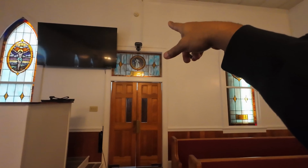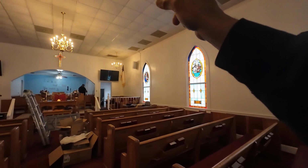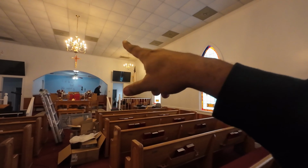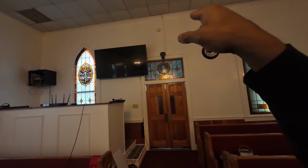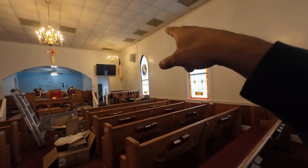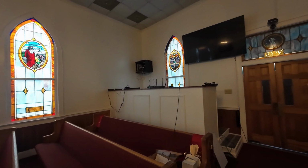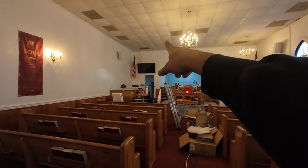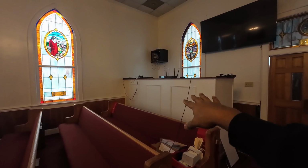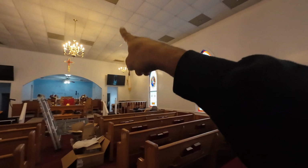Again, this cable that's going to this camera is already run all the way to the front. The idea is to pull that up out of the way, the Ethernet cable, run that over to where the camera is going to be in the front. The video cable, the HDMI that is going source to display, that was up here, I'm going to reposition that and extend that and connect that to that TV so that would be the run for that. We also need to extend the HDMI from here, which is also for here, run that back here so that both TVs will get displayed, then run one more cable in reverse so it's source to display for the front camera. We'll do that.